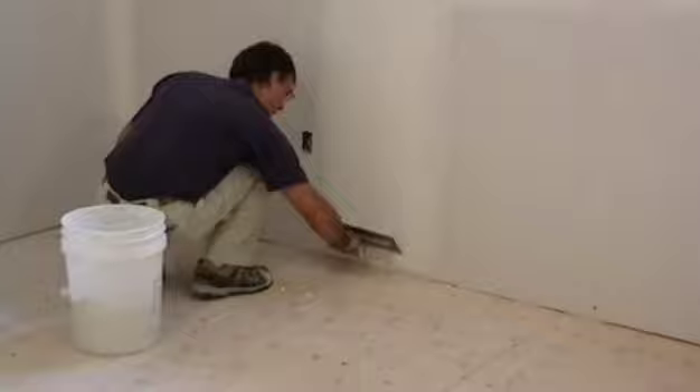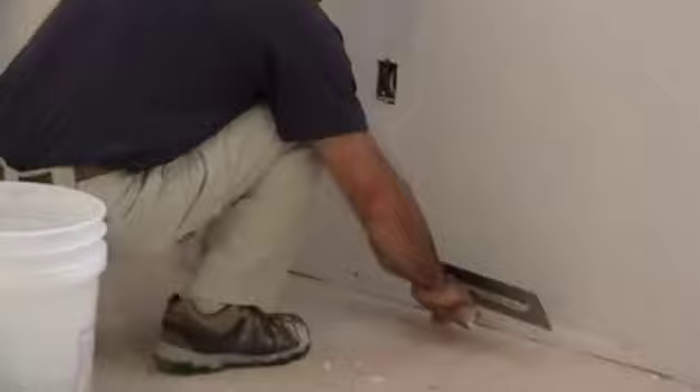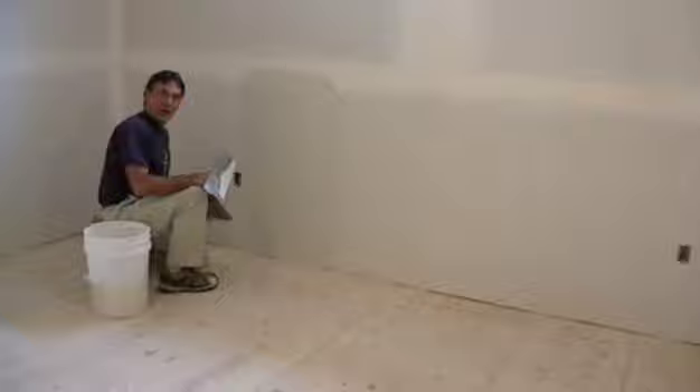I'm loading up the whole thing. As you're going up, you're flattening the trowel. Not enough mud - grab some more and load it up again. Right up to that joint, the other side the same way. What we do is reduce a little bit at a time - I'm not going to take the trowel right up to take a lot of mud away all at once. I'm just going to press on the tip of the trowel to feather it off against the board. Go back to this side, bring it down a little lower, pressing on the back of the trowel to feather it off. Now take a swipe up the center. There are little bubbles and lines in this joint, but the tape is hidden.